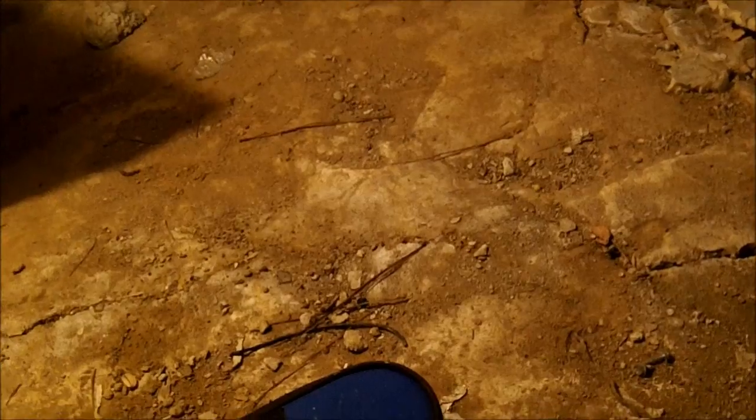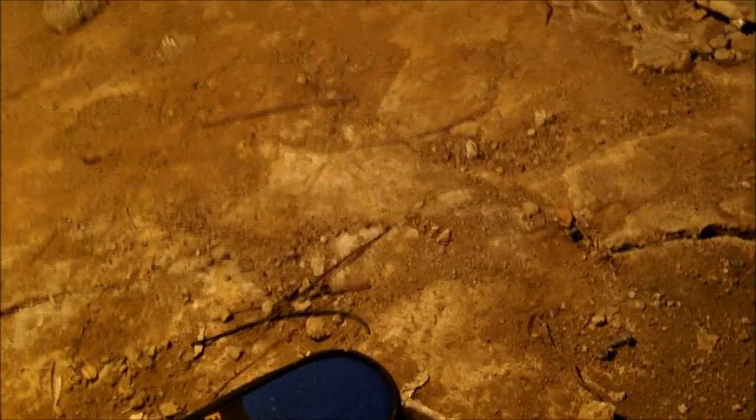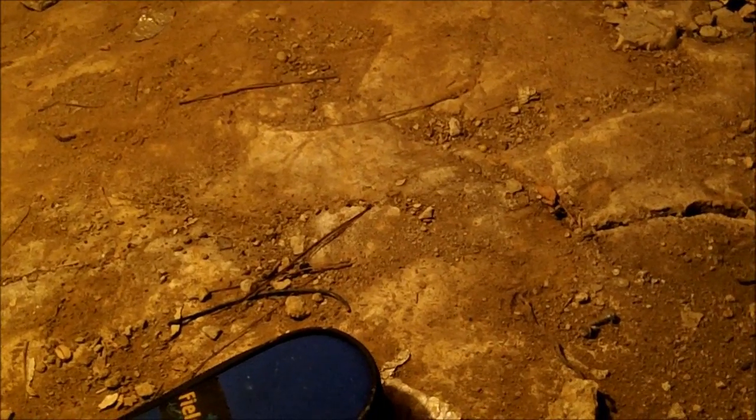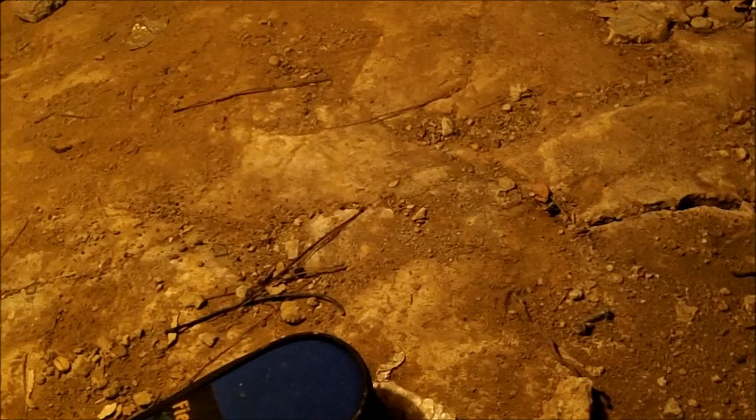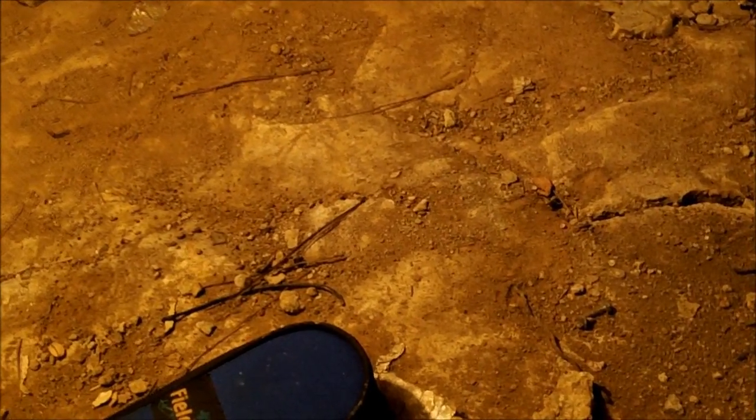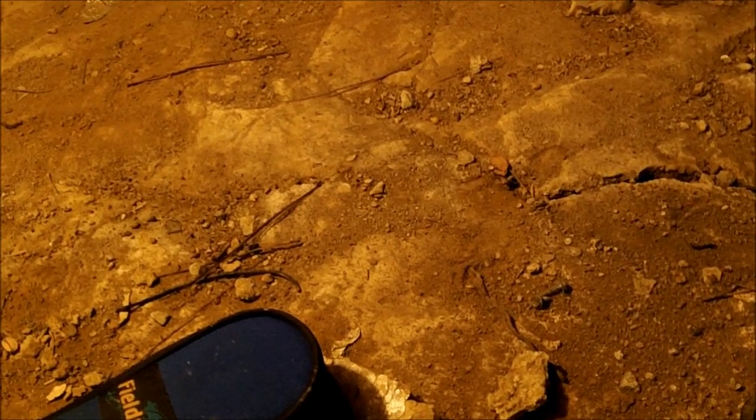Really filled. Yeah. So what happened is the airflow stopped because of no air going through there. The furnace got so hot that the limit opened up, and they're supposed to be automatically resettable, but this one is stuck, so I opened it back up. Is there something that I should know just so you won't have to come and... No, I mean... I really appreciate what you've done.